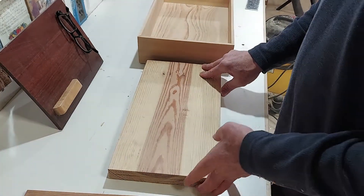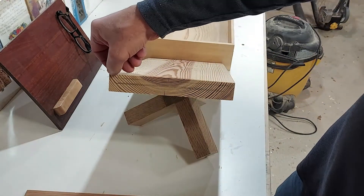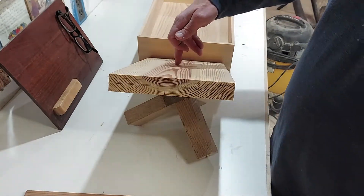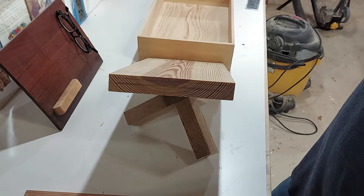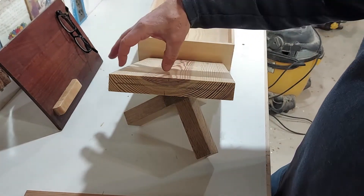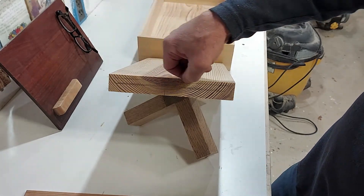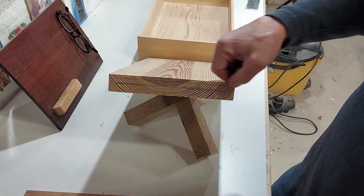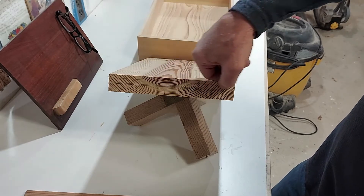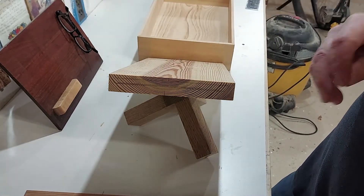What we're going to try and do is cut this in half, right down the middle of this redder grain. Those will become the two faces of the door — the two door panels. I'll cut this in half and then rip it on the bandsaw so that each one of these is about a quarter inch thick, and I'll use those as the panels. What's left — this other half — I'll use that as the rails and stiles for the door.